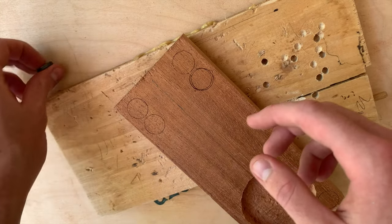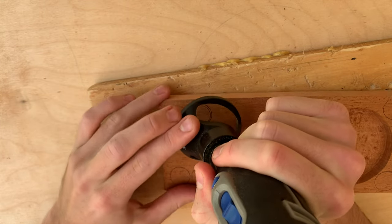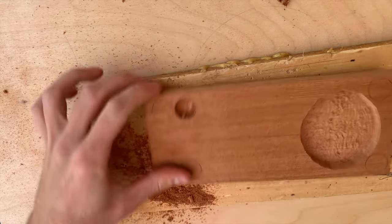The next step was to carefully cut out the guide lines I left, and I used the Dremel 561 again for that. I also cleaned it up a little bit with the 562 on the bottom and the sides, but this hole just had to fit the magnet and not burst through. And it's not visible from the front, so aesthetics aren't super important back here, and I'll cover it up later anyways. I'm also going to cut out about half a centimeter to fit these small magnets, so the whole thing can mount onto a fridge. The large magnet is somehow only magnetic on one side, so it alone doesn't work to stick it to the fridge. I used the 561 and the router attachment again for this.